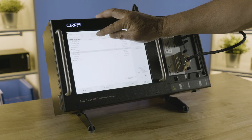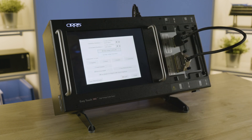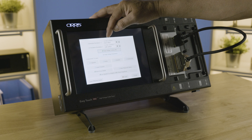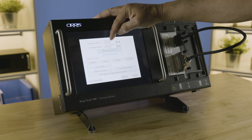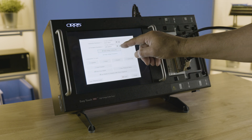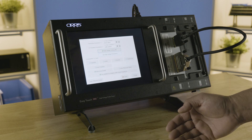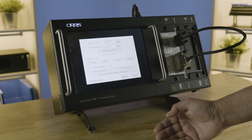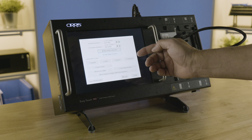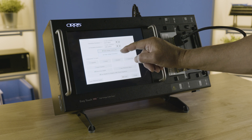To learn a cable you're going to hit Create Test, then pick Learn Test Program. You can change your defaults here. This is the connection resistance — the maximum value of resistance you're going to allow for a wire connection. The default is 10 ohms. The low voltage insulation resistance is used to determine if you have a short or a high resistance connection. You want to set this high so you pick up a high resistance connection under 100k ohms. We want to run a high voltage test so we're going to leave high voltage testing checked.